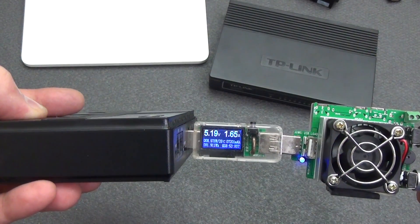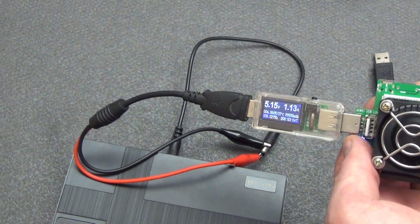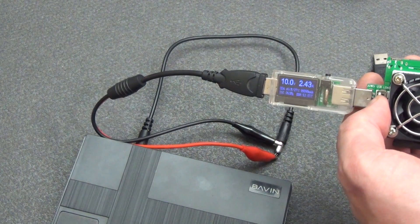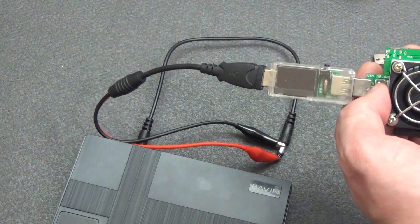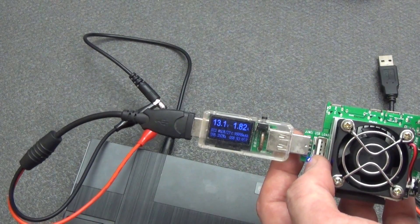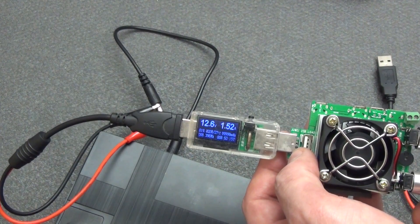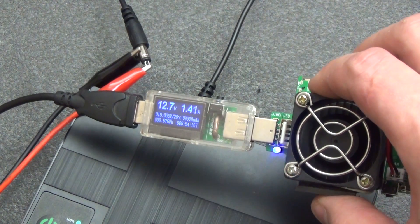First, I'll check what current load is on the USB port — as you can see, the port outputs 3.2–3.4 amperes. Very good. Now let's check the 5-volt port — here I see 2.5 amperes, then the device went into protection. Now the 9-volt port — it gives out 2.4 and then 2.3 amperes before protection. The most popular will likely be the 12-volt port — from it I managed to get 2.4 amperes before protection. At 1.5–1.7 amperes everything works correctly. In general, this is enough for a router, GPON terminal, and there is still some left for a switch.